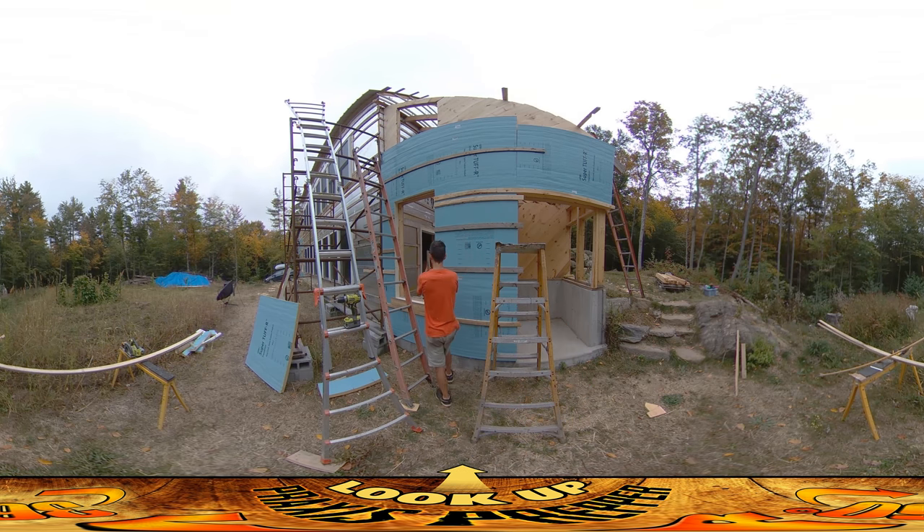So this is how I'm putting these guys up — you're just sort of eyeballing them, getting the nails started, then choosing a ladder. This one seems most appropriate. And this is going to go right up in here. Just as I'm climbing up the ladder, I notice I'm missing a piece of foam in here. I'm going to add that. Before I completely tighten down these nails I'll put that in, otherwise it'll be a lot harder to get it in later.